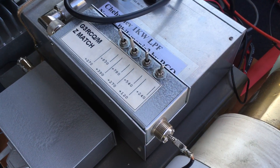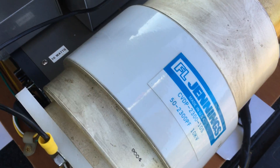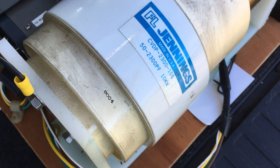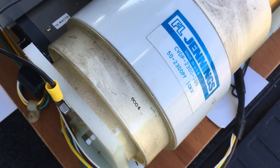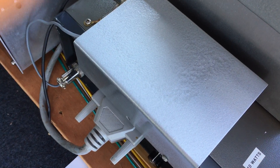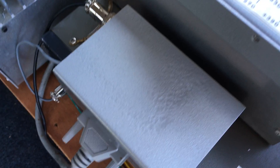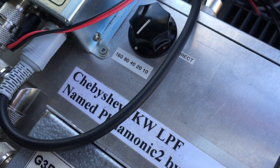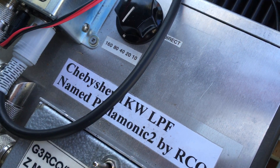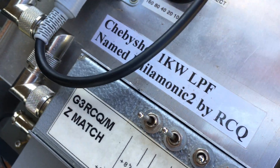The whip is tuned by a capacitor network, and in series there is a Jennings 2300 picofarad vacuum variable. In this box is the speech compressor and noise gate, so there is no car noise when we are mobile. In here is a homemade Chebyshev filter which I've called the Philharmonic II.